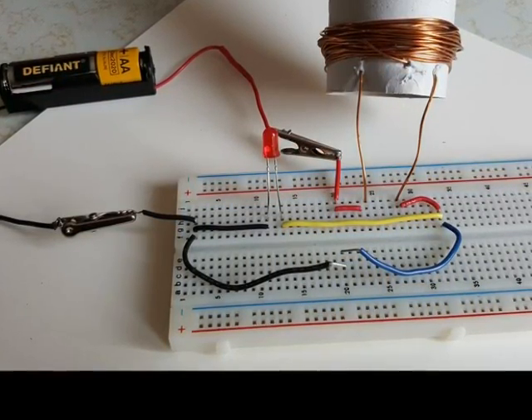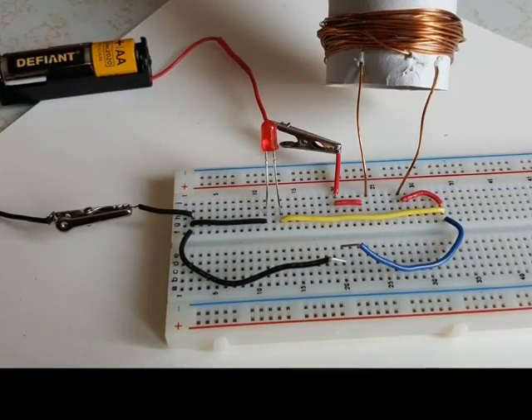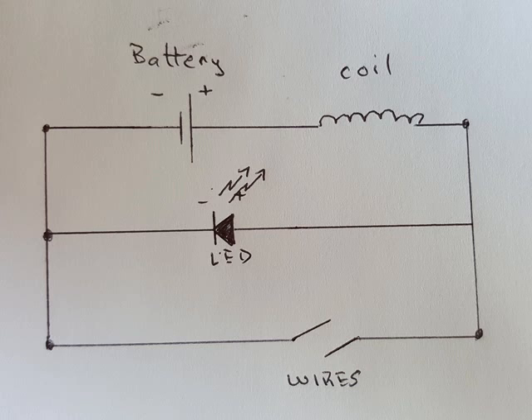I'm going to move on to the next slide where I'll show you a different representation of that circuit. Here we have what they call a schematic diagram of the single flash Jewel Thief circuit. It's got the same components. You can see that there's the battery that leads to the coil, and then two return circuits — one that goes through the LED and back to the negative side of the battery, and the other one that goes to our two disconnected wires. If they were connected together, that would lead back to the negative terminal of the battery. Electricity always wants to flow in a circuit from the positive, along wires, through whatever mechanisms there are — the coil or the LED — and back to the negative side of the battery. That's an electrical circuit.